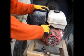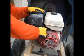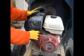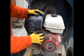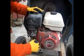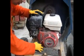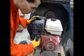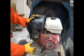This lever here will control speed. All the way to the right is the slow speed, which is what you want it to be on while you're adding stuff. Then when you're ready to mix, bring it over to the left. Don't shut off the mixer once you've got stuff in there — it's a lot harder to get it started with a full load. So to start it up: speed slow, knob and levers to the left, and give it a pull. When it runs smoothly like that, you're good to go.